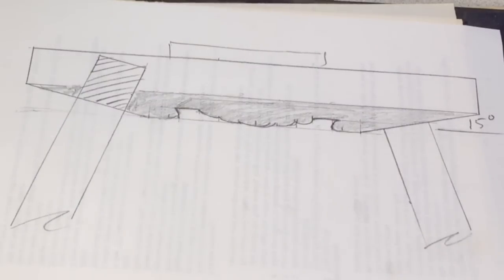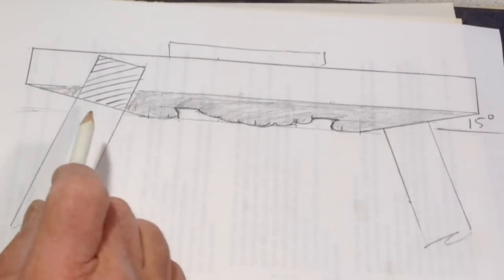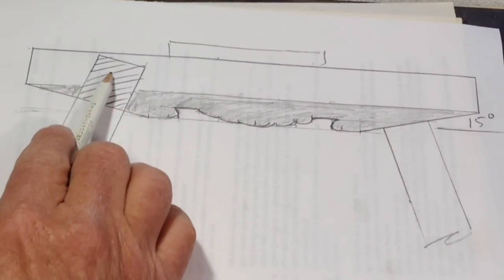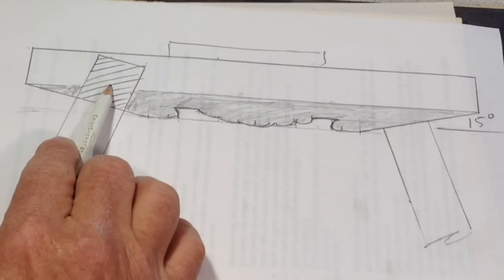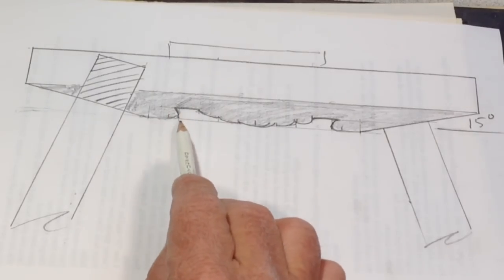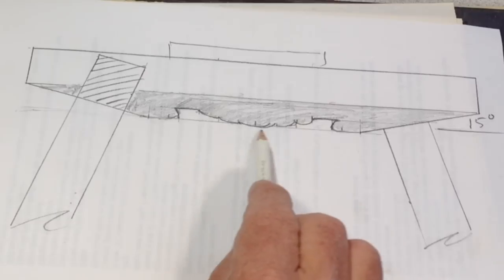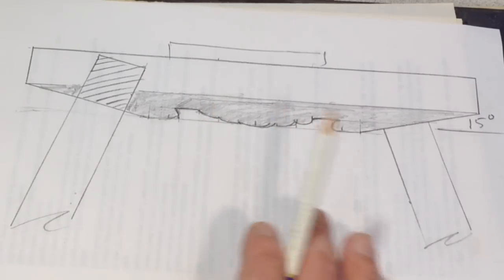So this is where I'm going with my stool. The leg will go into a 15-degree chamfer, and the leg will not go all the way through — I just stop it just short, mostly because I'm not very good at joinery and I'd then have to deal with wedges and that kind of thing. In the bottom, I'm going to expand a collet into these jaws and the bit in the middle will be decorated with some kind of beads. So it's pretty simple.